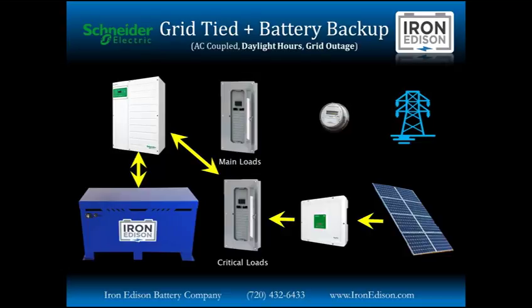At that point, we'll power our critical loads exclusively from the battery and at the same time discharge the battery enough so that we have enough headroom, if you will, so that we can have a place to absorb that excess solar production. When we get to that point, the XW Plus is going to shift that output back to 60 hertz exactly. Our string inverter will see that, requalify that power, and resume its solar production. So there's this constant push-pull relationship that the XW Plus is utilizing to manage the solar production and keep the critical loads output exactly where it should be.